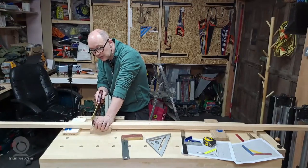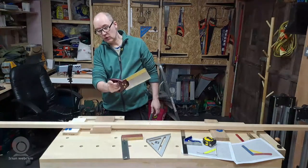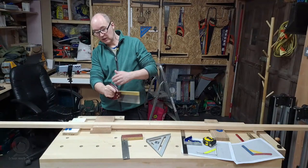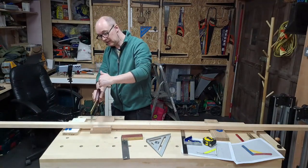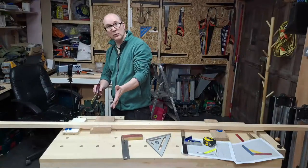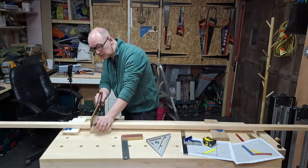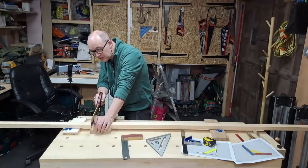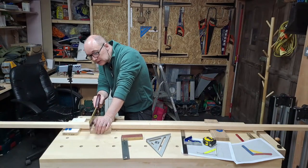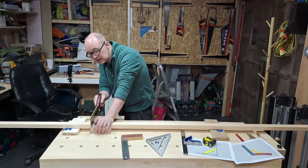When we're cutting, ideally to keep our straight line, you hold the saw just with these two fingers and your thumb, index finger straight out, your blade, wrist, elbow, shoulder in a straight line. See, I'm standing out of the way of the line. I'm not in front of it, I'm to the side of it. So my arm, the blade and shoulder can be in front of that line. You've got to keep blowing that dirt out of the way just so you can see that you're standing on your line.